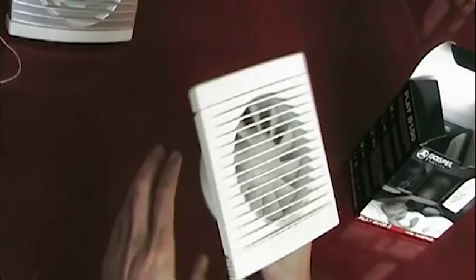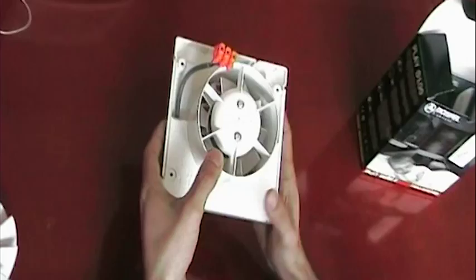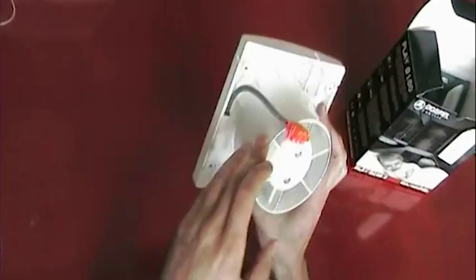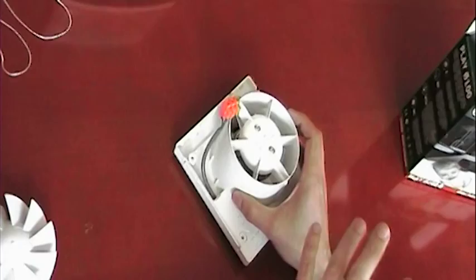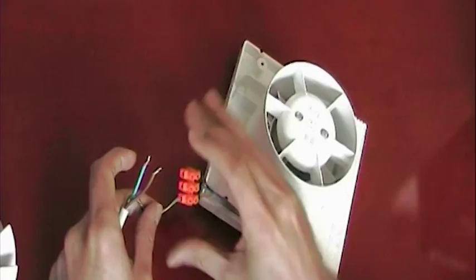These devices are designed to be installed vertically on walls. Attaching these devices to the mains is a really simple process. You have the connecting block and three colour-coded wires. You join the yellow and green wire and screw it down to tighten it, then connect the blue wire and the brown wire, screw them in, and the unit is ready to go.